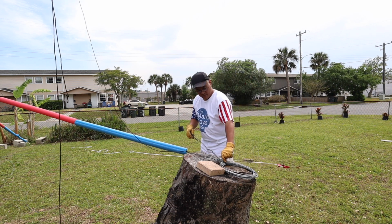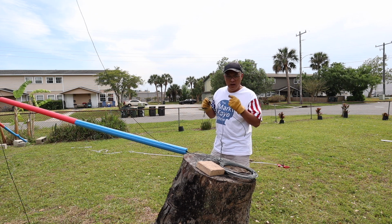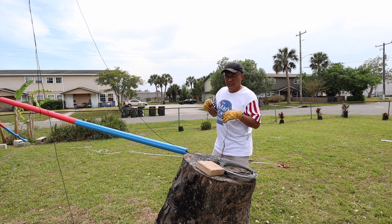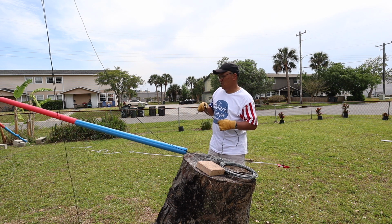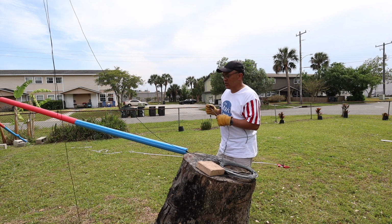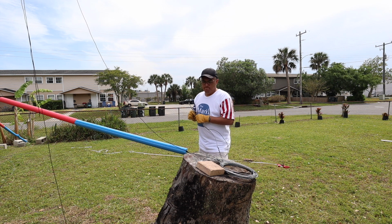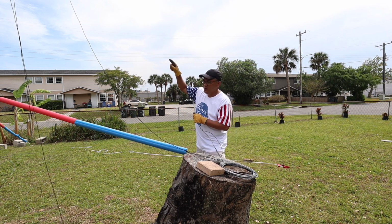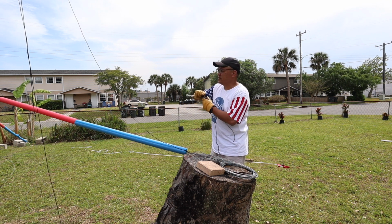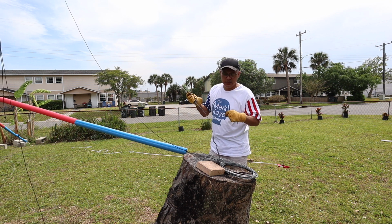Well, I muffed up the top guy wire. My math was wrong, and then when I recalculated the Pythagorean Theorem, I'm like 5 to 6 feet short. So what I'm gonna do is save the guy that I already cut for a later project. And later I wanna show you how I came up with the required guy wire length for the top mast plate. So right now, I'm just hooking up the middle section, and I'm just going to go with that and order some more of these guy wires.